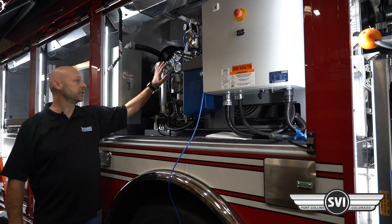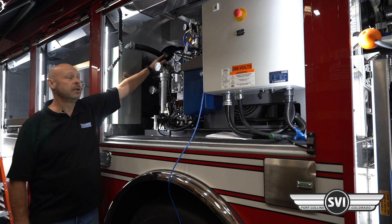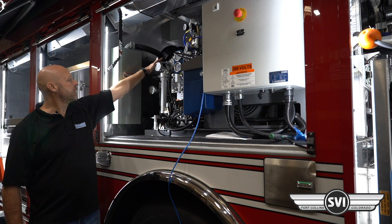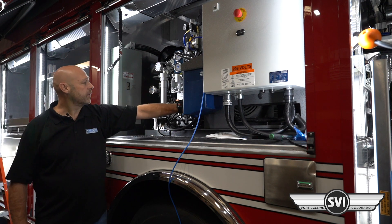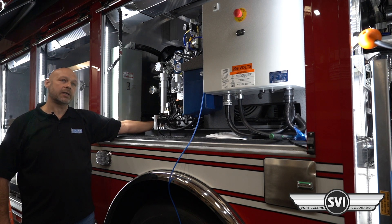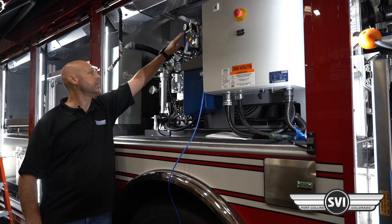It's a five-stage machine. The first stage is right up here and will always have your air cleaner — your inlet filter — on it. The second stage is down below the first stage. The third stage is off to the right. The fourth stage is stacked on top of the second stage. And the fifth stage, the final stage, is up to the upper right.